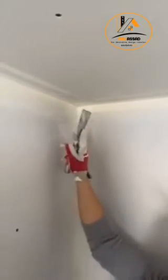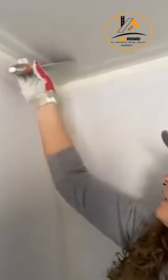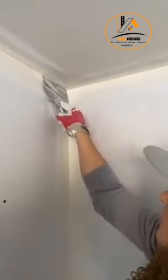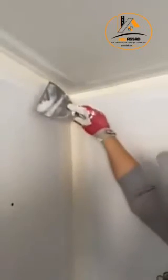So there at least I have all my tape tight for the most part. I have all my excess mud out. So now I'm going to come back again — I have this all the way in there. I'm going to wipe. And then I'm going to come right here, push a little tight because there's a little tiny wrinkle right there. I want to get rid of that. I don't want to leave any excess mud in there because that's just going to cause problems later.